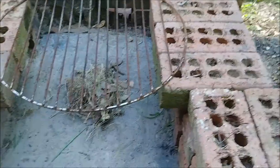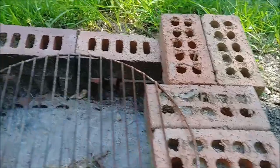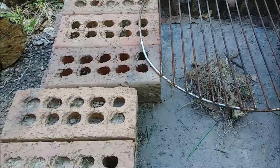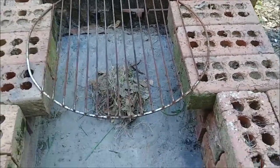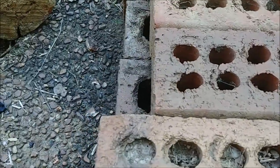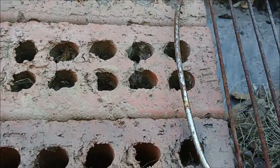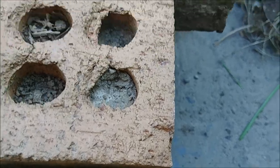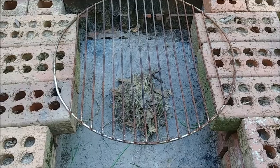This fourth course is a bigger, thicker brick, and it's all going in the same direction — not preferable, but we're coming up with at least two more courses so it won't make a whole lot of difference. The weight of the brick is what holds them in place. If you'll notice how I did this ledge part here, you just slide three bricks forward toward the interior, leaving about an inch and a half, maybe two inches overhang — enough so you'll have a place to put the lower grill.